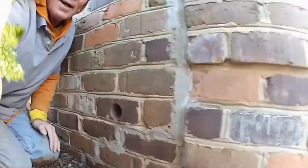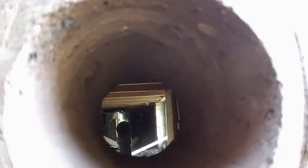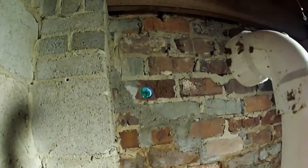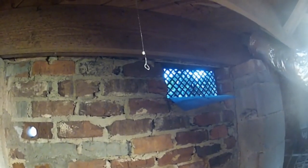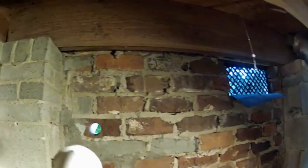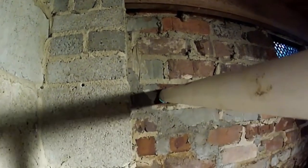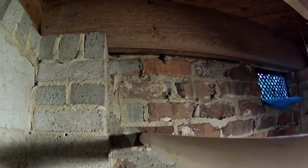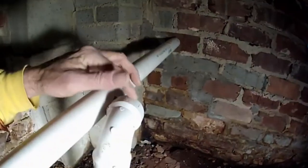That's pretty quick work on that brick — you can see we've got a nice clean hole, and it should line right up with our discharge from the sump pump. Down in the crawl space, if you count over three bricks from the bottom of that vent and drill directly underneath, that lined up exactly with what we wanted. Now we're going to push this piece of inch-and-a-half right through this hole — you can see it slides right through there, really nice. There's a bushing on the outside so that's as far as I can take it right now.